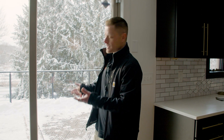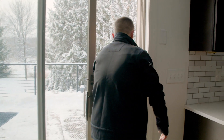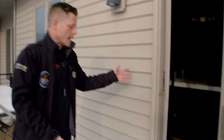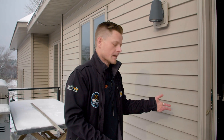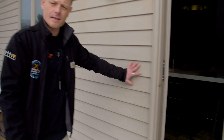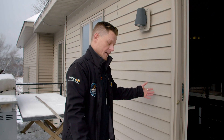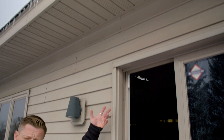Some of the issues that we might see when we go to install a new door would be dealing with the siding. In this case we have vinyl siding which, depending on how old the siding is, could be fairly brittle, so you've got to be very careful when you're taking it off. There's also the issue with house wrap — if there's house wrap behind the siding, or sheathing behind the siding, it could be in bad shape. There might not be a drip cap on the old door either.